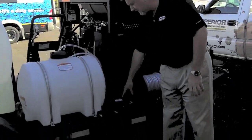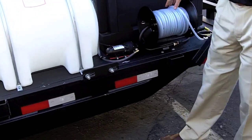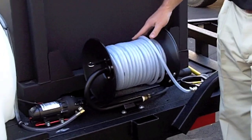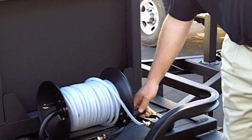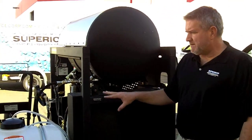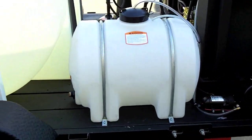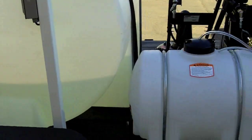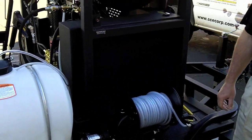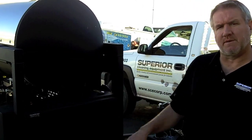Or we put in a 120 volt FlowJet SureFlow pump, which feeds about 100 feet of braided vinyl line with a gun and a wand, and there's a little hose reel here for it. So you can inject that soap at one to two, one to three — whatever you have in that tank, direct. If you're cleaning dumpster areas, degreasing frames, heavy driveway stains — you can take this wand and run it one to three, one to two, one to one — it does an outstanding job, lets the soap do the work. Or for regular washing and soaping, you can run it through the downstream injector at a much higher ratio. So it gives you two different options for chemical application.